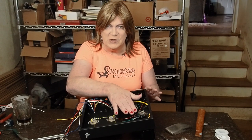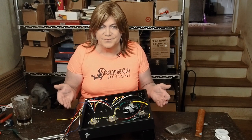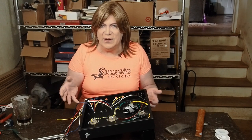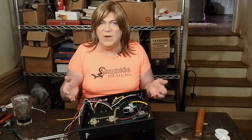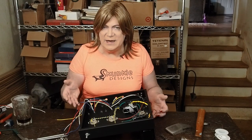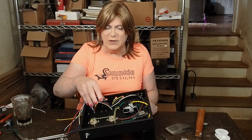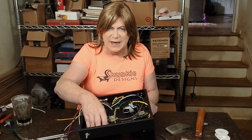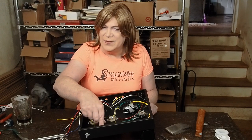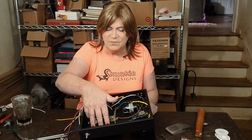I'm going to get into the power supply soon, but I wanted to talk about grounding and how important that is on a tube amplifier. I use what's called a multi-star ground grounding system. Star grounds are a way of avoiding ground loops. The main thing you need to understand is that it's okay — and I've done this on several amplifiers — to congregate like grounds together and then bring them all into their own kind of remote star ground, and then tie that back over to the main star ground.